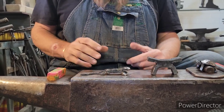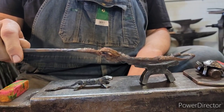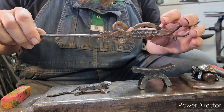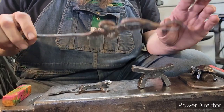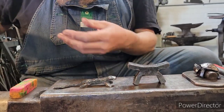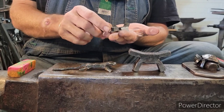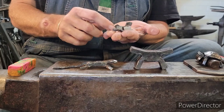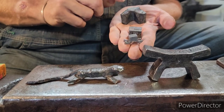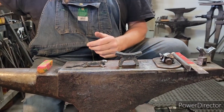Not all my stuff has worked. The first couple of lizards — here's one I grabbed out of the scrap pile. Look at that ugly piece. I was trying to forge a lizard out of one piece and a bar, still got the spider webs on it. It didn't work. When the legs broke off, I didn't have enough material. That's where I started using things like this, so I have enough material. Some of the turtles — right here's a pile of turtle parts — some that didn't work. I didn't have the right material. This little dude, his head broke off. I had it way too skinny, too thin. This one I cut wrong. This one had way too much material for the legs but not enough for the shell. You have to practice, you have to try it, you have to move the material.